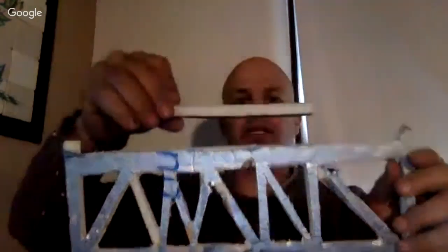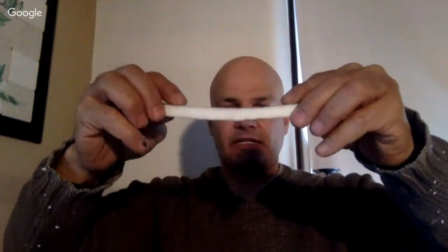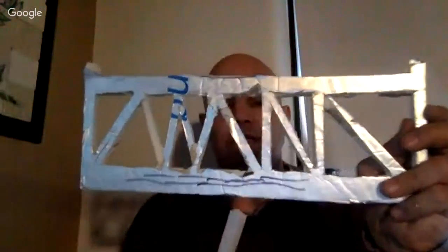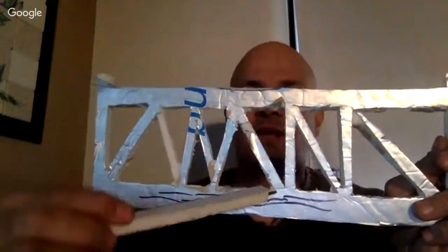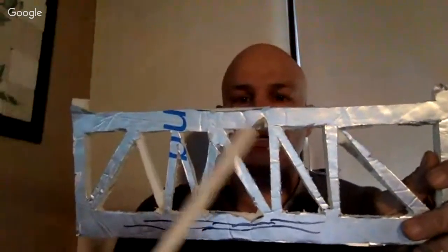Now, so you can visualize this top canopy, its radius, beautifully so, like this. It also will want to do the same thing. You want to see tension down here and compression up here. The same deal here and here. Tension down here, compressive up here. If it was deflecting at that point, you just saw what I did, you would see a break in this concrete, more than likely, depending on how elastic it is.